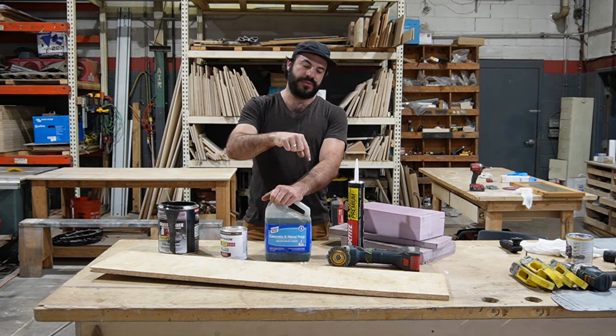And so maybe you only have a little 3-inch piece here, and then another 3-inch piece here, and you have to cut out your wheel well around it. And it's going to make a really weak piece of either wood or ply or insulation. So if you look here, my next piece, keep in mind these are 48 inches wide, so I'll be cutting out a notch there. And then look where that 48 ends. It ends right in line with my wheel well.